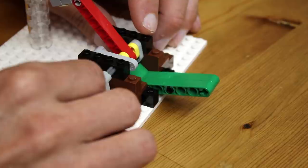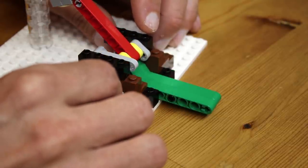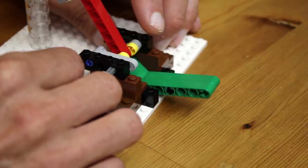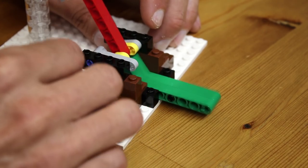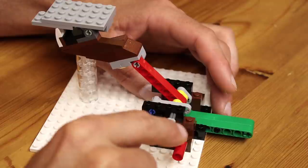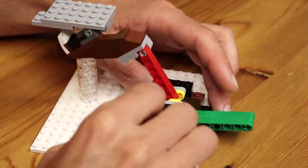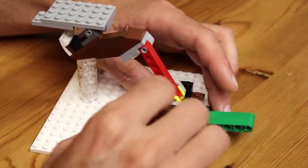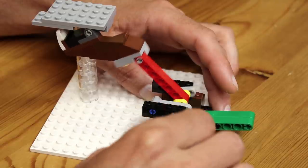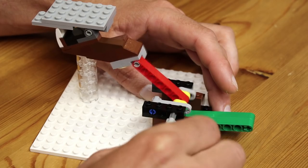It only engages the tail for about a quarter of the rotation of the drive shaft, so that as it continues to come around it essentially releases the tail so that gravity can pull it back down to slap on the table. The drive shaft also acts as a crankshaft driving the red lift arm as a piston which is connected to the jaw assembly. The jaw assembly is hinged in the middle so that as the piston drives the back of it up and down, the front will move in the opposite direction giving us a nice chomping of the teeth.